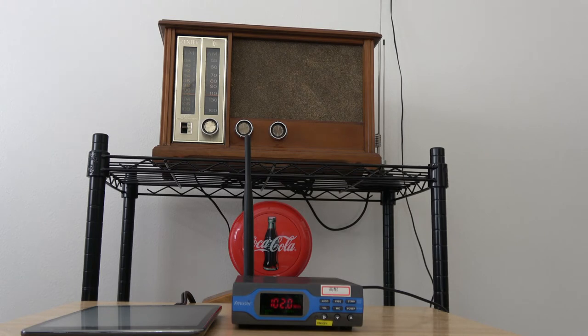Some things I like: the setup is very easy, it sounds pretty good, and you have a lot of audio input options. I also like the selectable pre-emphasis — the 50 microsecond European standard and the 75 microsecond American standard. Being in the USA I'll use the 75 microsecond setting. On power output, this puts out one watt. A lot of FM transmitters out there put out more, but the FCC limits the power you can put out without an FCC license, so you want to keep it legal and avoid the FCC coming to your door.